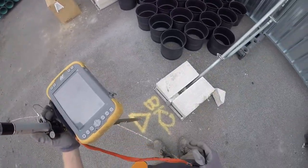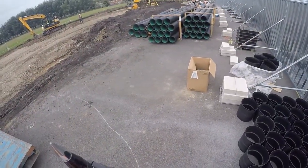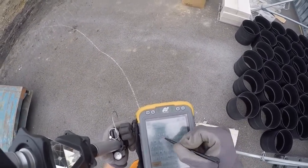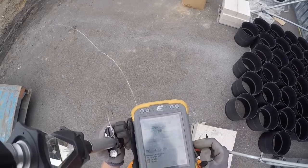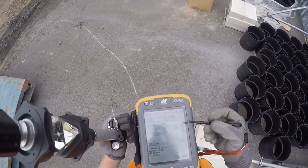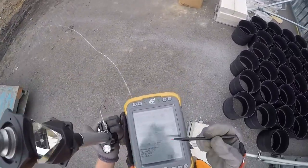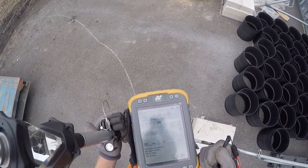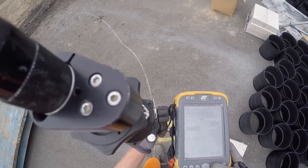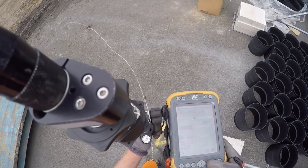Here we are at our second station, which is BK2. We're set up over the nail and the machine is locked on and tracking us. So we enter our next station point in here, which is BK2. The points for these are already stored in this machine. Height to the receiver — we don't have to change it because the machine can still see us, so we can leave that at 1.5 and make sure that 1.5 is still in there. Then it's as simple as lining up the bubble in the hole again and clicking enter.